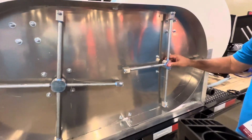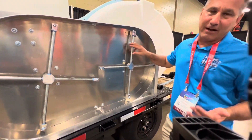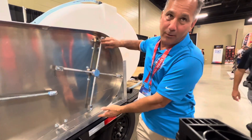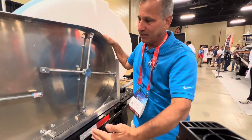These tornado bars — they reduce the streaking. What happens is now you got four rotations every turn opposed to two, so it's going to be faster. Guys tell me, 'Oh, I got a four-tip bar.' It's not the same — it's still only two rotations. That's why it reduces the zebra stripe.